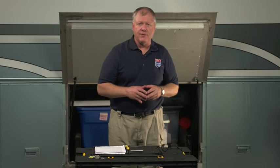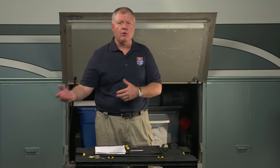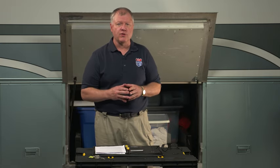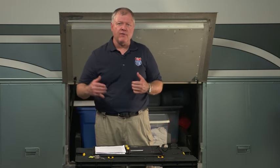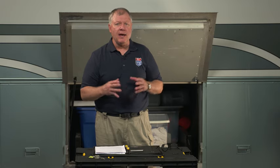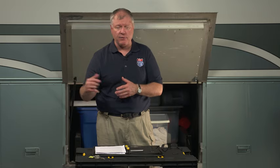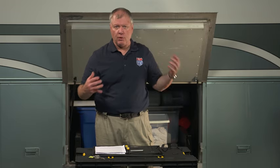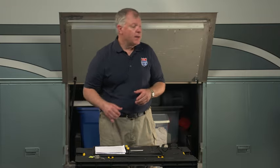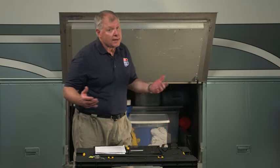One other thing that can happen — and I've seen this quite a bit — is that when you're camping and you go to break camp and pull the cord out without unplugging the electricity first, you sometimes get a little surge and it trips the GFCI, depending on how sensitive it is. This one happened to be in the bathroom area under the sink. You're usually going to find that outlets next to a water source are hooked to the GFCI — in the kitchen by the sink, a second bathroom, and in toy haulers the garage area because of moisture. Also, almost always the outside outlet is on it, and sometimes the refrigerator as well.